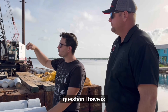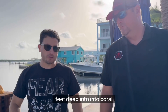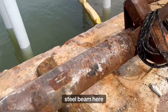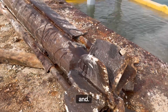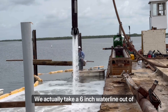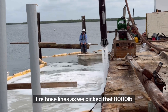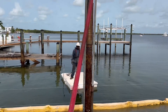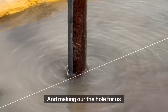The main question I have is how we drill the hole — how do we drill a 16-inch diameter hole eight feet deep into coral rock? We wet-punch our holes. On the barge, we have a steel beam with a six-star bit at the bottom. We take a six-inch water line out of the ocean and convert that to two inch-and-a-half fire hose lines. As we pick that 8,000-pound punch up and drop it to break the rock, those hoses are blasting the coral rock out of the hole, making our hole.